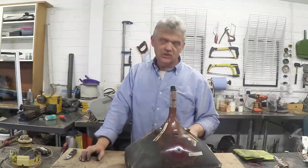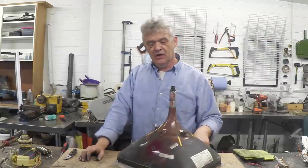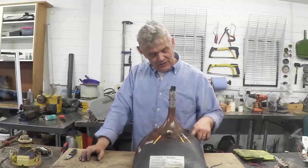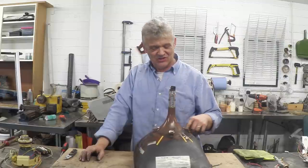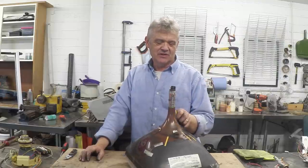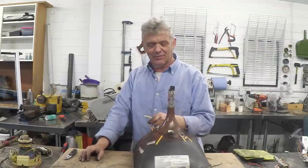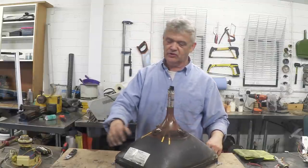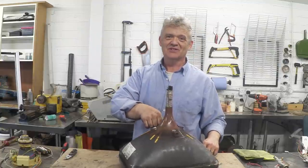The phosphors in here are also supposed to be very dangerous, so you're not supposed to breathe them in. And by itself it is actually a capacitor, so it can be a very lethal charged capacitor. This one I happen to know has been lying around for ages so any charge has now bled off.